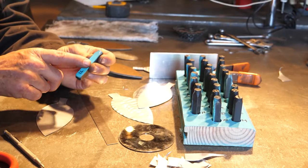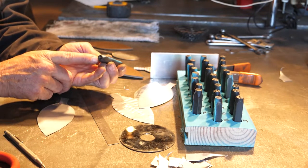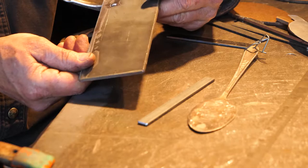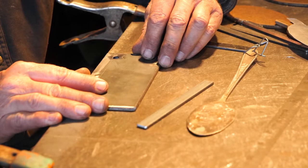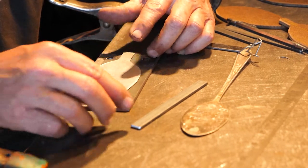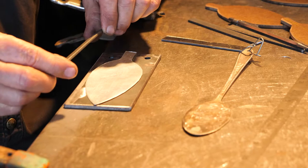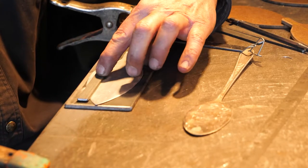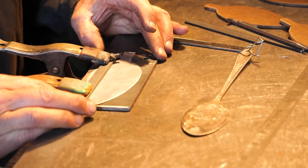They're alphabetized here and they're showing straight up. There's the F for family. This blue paint signifies that the paint should be facing you, and what that does is orient the letter the right way so that it doesn't come out upside down or sideways. In your kit you have a plate — a base plate — which you'll be doing all your hammering into; that's going to give you some resistance. Put that on your work table and put your leaf, spoon, or sprocket — whatever you've decided to use — on top of the plate. Then use this straight edge, which is what you're going to put your letters up against to make them all in the same row so you have a legible, readable sentence. Take a spring clamp to hold everything together so it's fixed and not going to move.